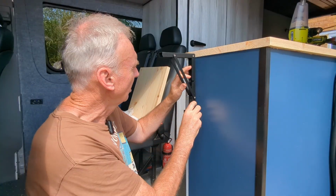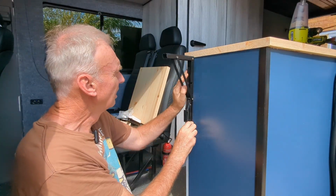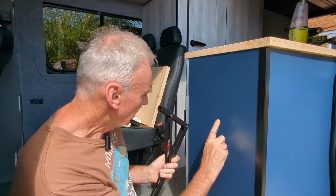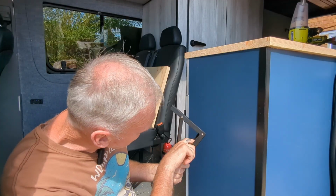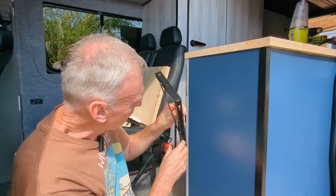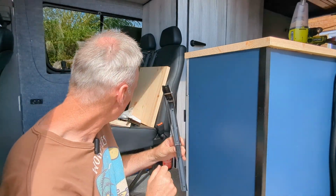Yeah, so just get those pocket holes in now. Right, I'll put on these brackets now for the flippy up bit at the end. I've already marked where my 3 holes are going. Now this is only a piece of 12mm ply, so I'm not too keen on just putting through a couple of little self-tapping screws into that, because if there's any weight put on that, I don't think it'll be enough. So I'm going to have to drill out these little holes a little bit bigger.